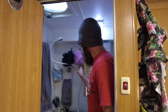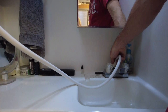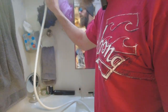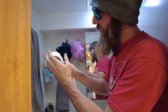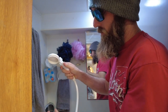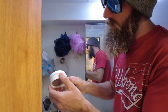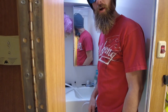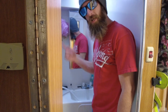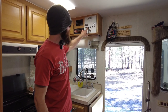You'll also want to completely drain your shower head. Take the bottom fitting off, place it in the sink, grab the top of your shower head, turn it to the open position, and remove this part to make sure there's no water in there so it can drain out. For safe measure, I like to leave this part unattached for the entire winter — that way if you ever wonder, you know it's draining in the sink where it belongs.